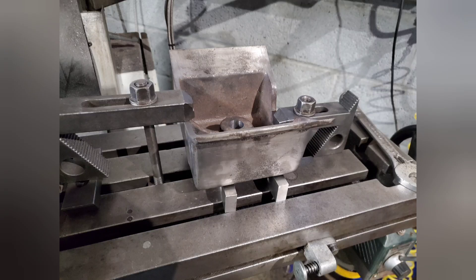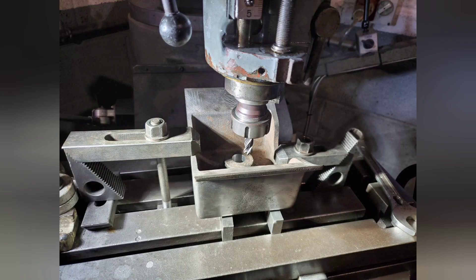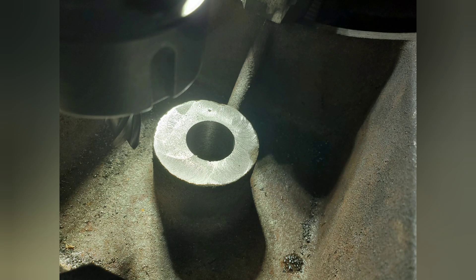As you can see, the pin now fits in. The next job is to mill off the surface which the head of the pin will actually sit on. As you can see, we've got it clamped down with two clamps on parallels on the surface which we just machined. This is then where the head of the pin will sit. Now we've taken it down to the right height from the machined surface on the other side.